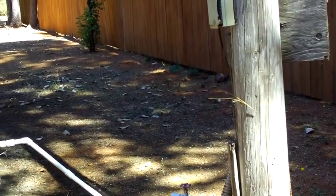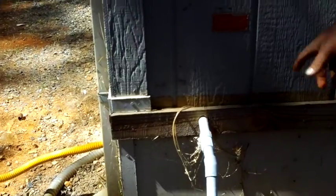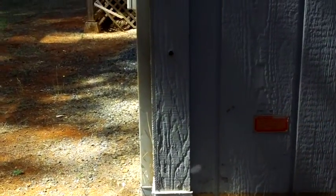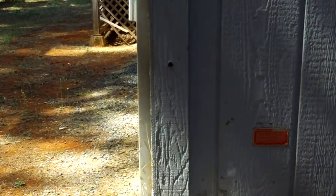Yeah, I think so. So here's the electrical, or the breakers. If it was mine to do, I'd drop this in about a foot underneath, dig a trench, and wrap the whole thing in insulation. And everything that's exposed, I double insulate. Okay, that's good advice.